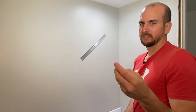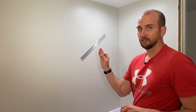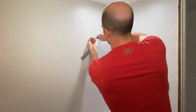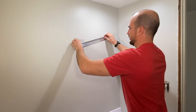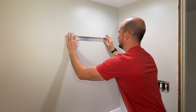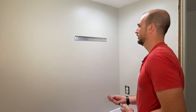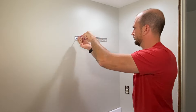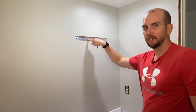To be truthful, I'm not in love with these plastic plug anchors for drywall. They come in the pack and I'll use them, but I would prefer toggle bolts — if you want a more secure hold I would use toggle bolts, drill it out and pass a toggle bolt through it. Now I'll bring the bracket back up into place and align to the slots, which gives us a little play to make sure everything is level. Our mounting bracket is now installed with two screws going through the anchors and one aligned to the stud.